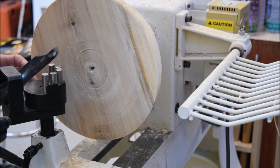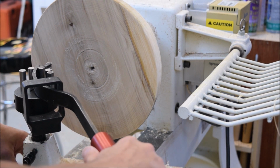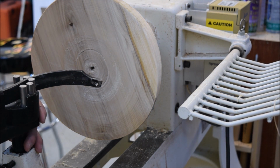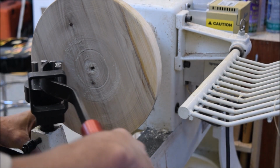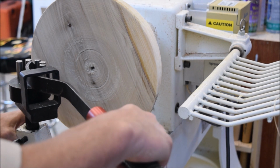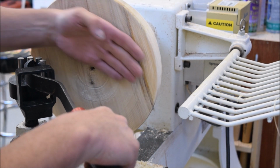The banjo goes in like this, and this goes through here. I gotta get rid of my tailstock, which is heavy. Okay. Now, we line this up essentially so that we can go in the bowl and curve around like that. The secret to it is to pull up on the handle and let it just rest and ride. So, I'll line this up right up against the bowl, but out here-ish. And the trajectory will be to go right in here.